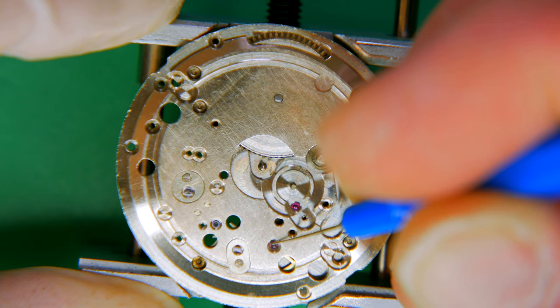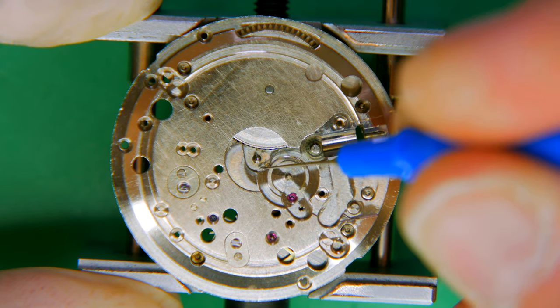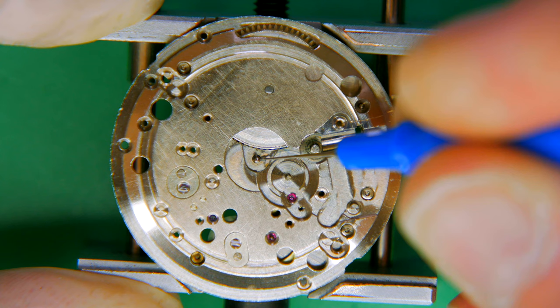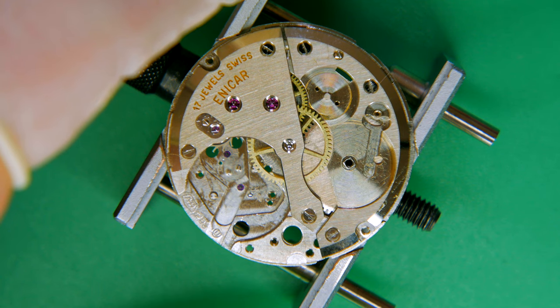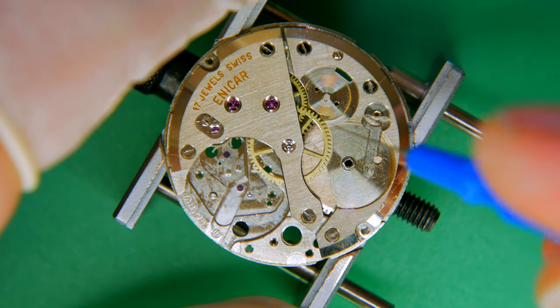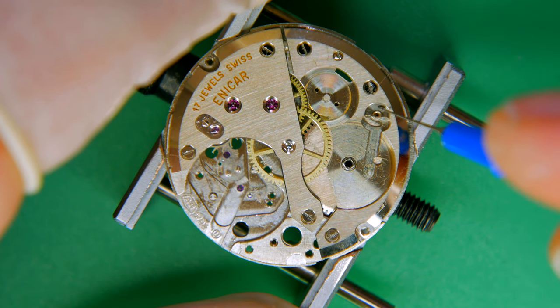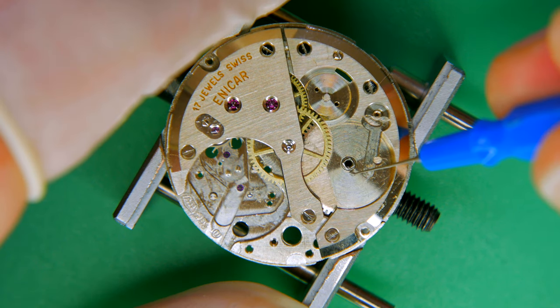So I'm just oiling the other side of the jewels using 90/10 and then a little 1300 on the center post. And the cannon pinion will then obviously slide on that later on. So now I can move on to the motions, where we can install the crown wheel and the crown wheel core, the ratchet wheel,